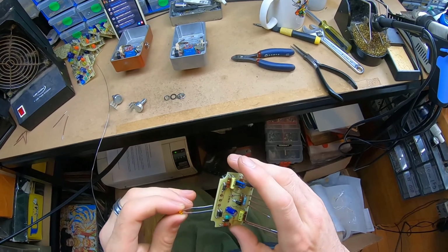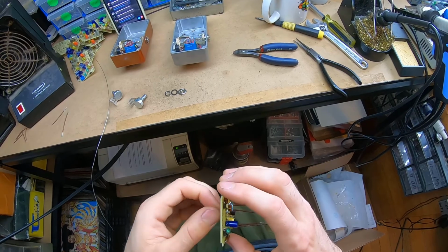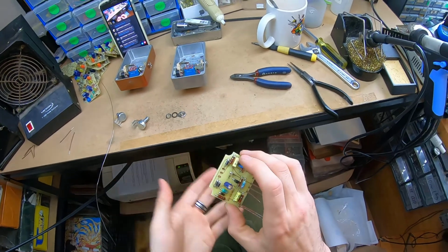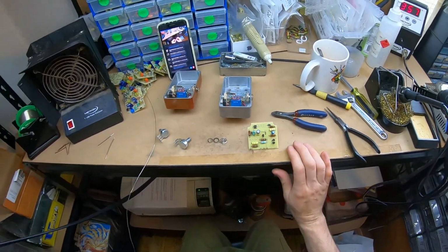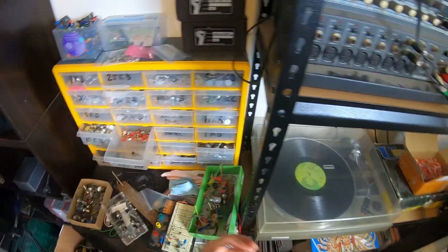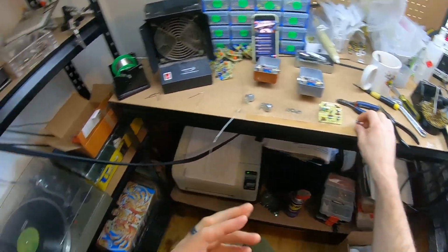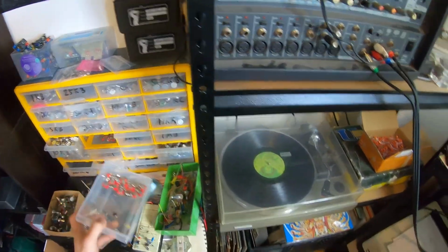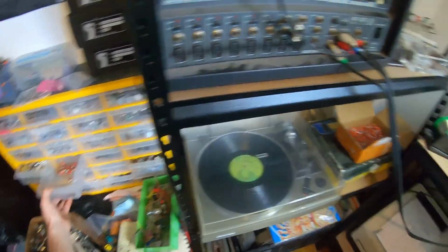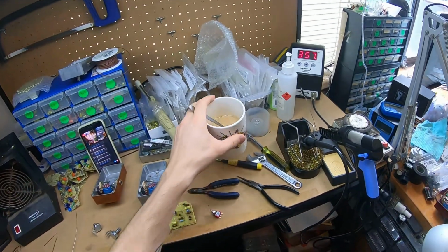Alright. I'm just going to put a kink right at the end. This bit's going to be clipped off just to stop it from running away from me. Now I need a single pole double throw center off switch. They're getting a little bit low. And always double check that you've got the right one, if you put in a non-center off or center off, you might cry. Might ruin your day, might undo an hour's work or something.